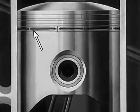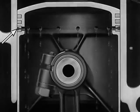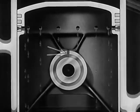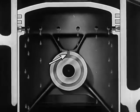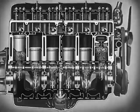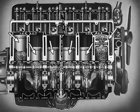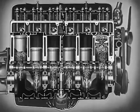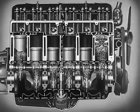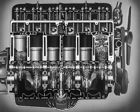A special ring on the piston controls the amount of this film. The excess oil is scraped off and carried through holes in the side of the piston to furnish the main lubrication for the piston pin. A steady stream of oil flows through the engine, bathing the crankshaft, the camshaft, valves, pistons and connecting rods, covering all the moving parts with a protecting film. The modern engine uses the same oil over and over again, four times a minute at normal speed.